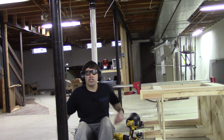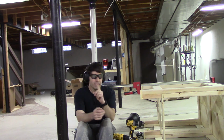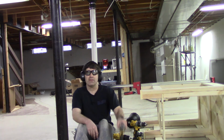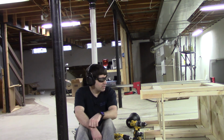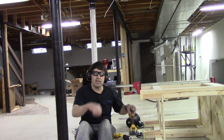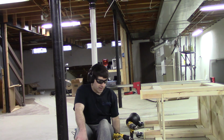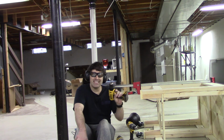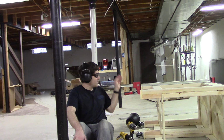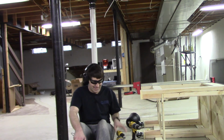So here I am, just about at the end of this build, and it occurred to me something all about efficiency. I've been doing one thing wrong. I've had my drill separate from the impact driver. What I have been doing is going between using the drill bit for drilling out the hole for the screw, and then taking this out and putting in my countersink bit, when this whole time, I completely forgot I have a second cordless drill. So, for the last 2, 4, 6, 8, 10 holes, drill, countersink, then drive the screw in.